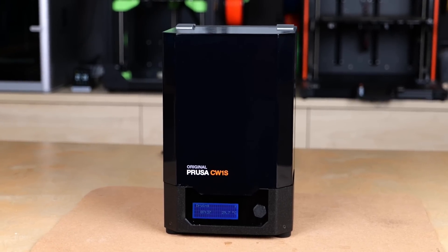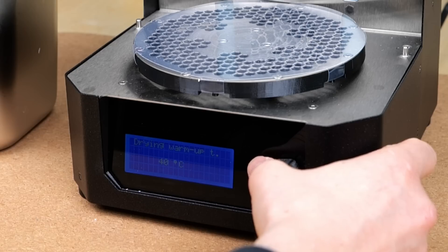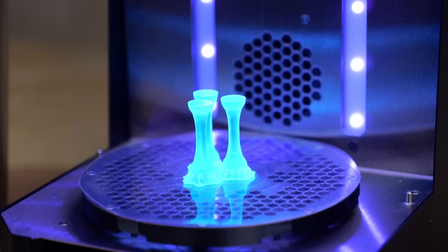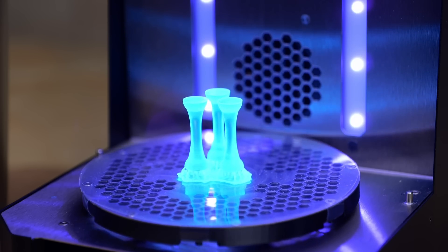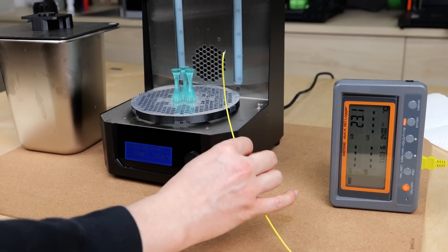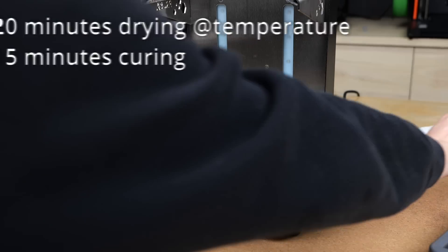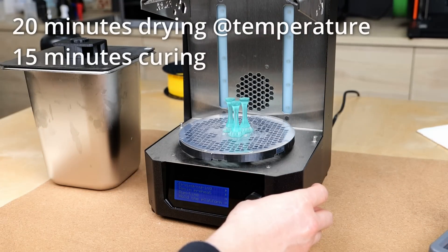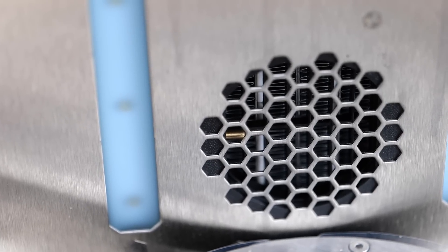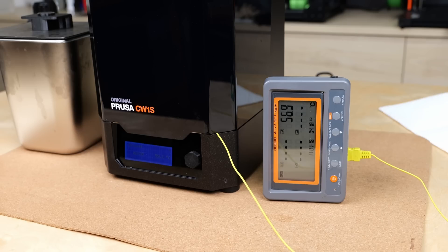I initially thought this was going to be easy and I could do all of my tests with this accessory. Unfortunately, I quickly learned that you can only set the temperatures for the initial drying step — yet once curing with the UV LED starts, the heater will be turned off. This means the temperature is going to drop during the curing process, which might reduce the heat curing effect. I set the curing time to the recommended 15 minutes from the datasheet and added a thermocouple to monitor temperatures near the samples. Since the chamber was closed, it self-heated and the ambient parts ended up at roughly 26 degrees Celsius. For the other sets I set drying temperatures of 45 and 60 degrees Celsius, landing at approximately 42°C and 58°C during drying, though they dropped quickly once UV curing started and the heater turned off.